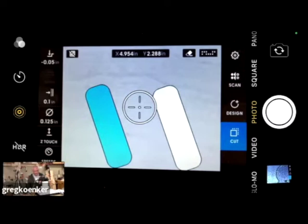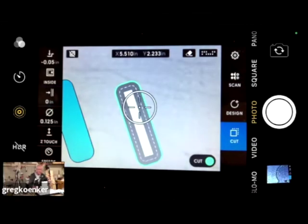Normally what they tell you on the shaper, and probably a good rule of thumb anyway, is to go no deeper than the diameter of the bit in a single pass. So if I have a 1/4 inch bit, I would do 1/4 inch steps in depth. So if I'm cutting through 3/4 of an inch of some kind of wood, I'm going to take 3 passes on it. One of the things that the offset does for you, if you look at it, I'm going to go to this next one that we have here, and I'm going to cancel the offset. We'll go to 0 offset. So you can put in an offset because you're doing 3 passes to cut that out. If you want that to be a really clean cut, and you're doing 3, you might have a 1/1000th of an inch difference between the second and the third, or the first and the second, or whatever.